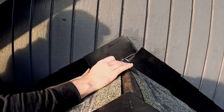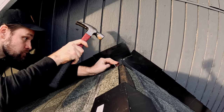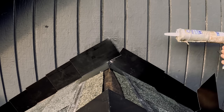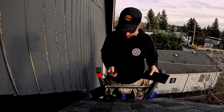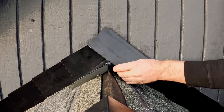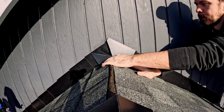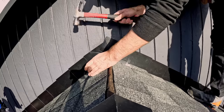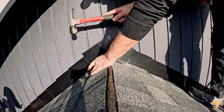The next morning I had a better understanding of what I had seen in those tutorials. On one side of the roof I did a straight cut, bent it over the front, and then added a bit of silicone in the spot that's most likely to leak. I then overlapped that with a mirrored piece, pressed it into the wall, and nailed it off. I added more silicone and then added another piece cut at a 45-degree angle. I then bent up another piece at that 90-degree angle and nailed it on to the opposing side.